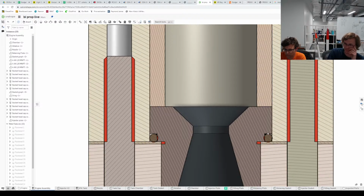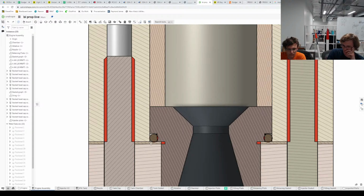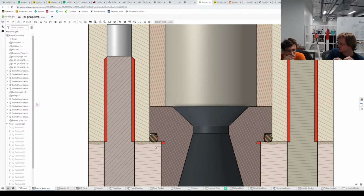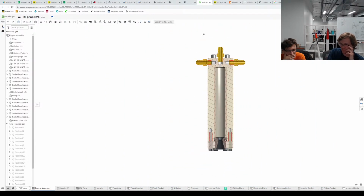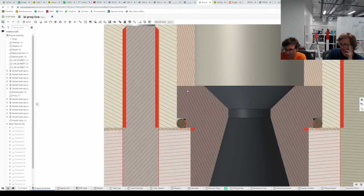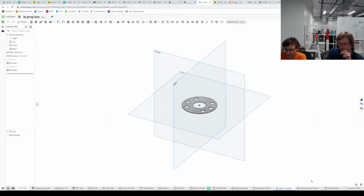Oh, I think this is kind of screwed up down here. We wanted this to be seated on this face. We didn't want the gasket to come into here. The gasket's going to stop right here, and then we're back in here a little bit, and the O-ring was going to seat on this face and that face. Actually, all four. It's going to get kind of squished, though. That might have to get adjusted, which is going to shift the chamber around a little bit. But you just changed the diameter of where the gasket hole is. I know, but look at where the O-ring's at. This whole thing is going to get shifted down a little bit to bring that in. Well, it doesn't necessarily have to be seating on the retaining plate. I guess so.